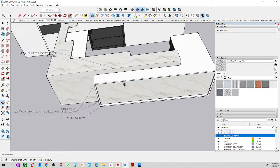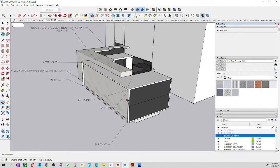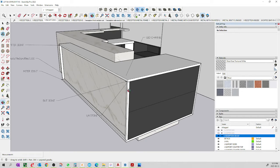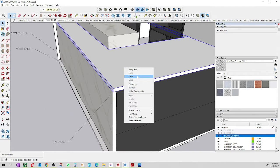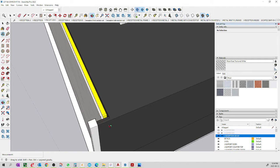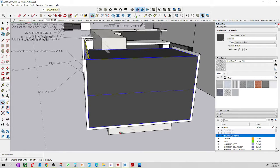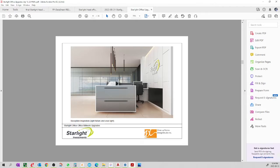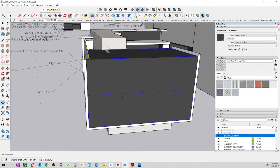There are two cabinets with a waterfall look — everything is 45-degree mitered. We couldn't do 45 degrees here because it's a small strip, so we need to confirm with the countertop guys whether it can be mitered or if a butt joint is acceptable. We have the LED light, the build-up, and the stone, with doors overlapping the filler to achieve that one-inch look all around.